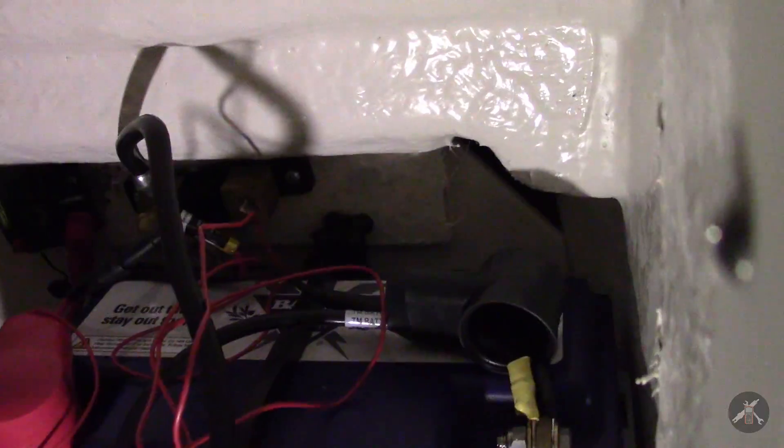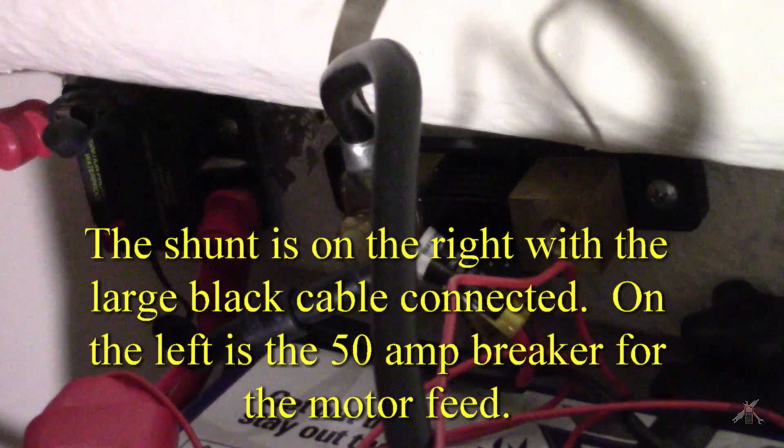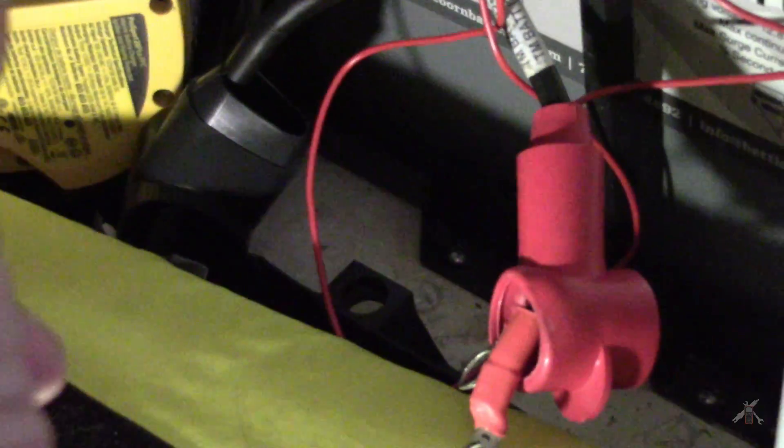They're a little extra tricky because of my monitor here. There's a shunt on the back of the battery compartment. That down there is a shunt. In order to get the current measured properly, one of my front batteries — the one that I removed here — its ground connection, the ground return for the charger, needs to go to the shunt instead of to the battery in order to properly pick up the charge and discharge current. That's a discussion for another day.